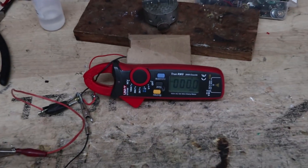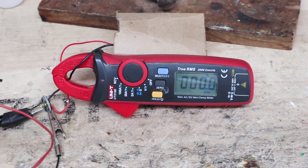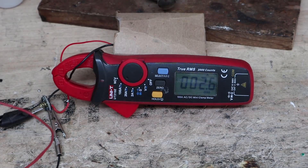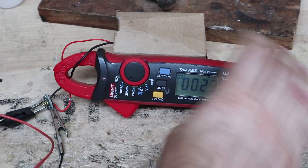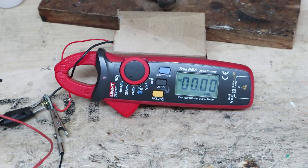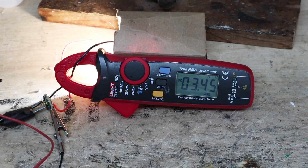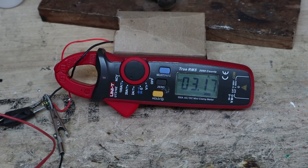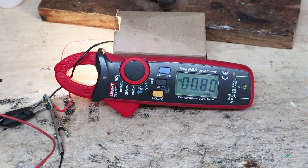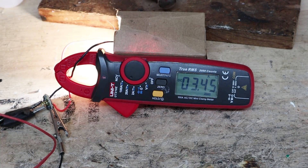Time to see how we did — time to set the meter to the correct setting. Let's check our lower modes: up to 50 milliamps there now, so not too much change. 800 milliamps on the medium mode. And 3.45 on high.